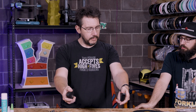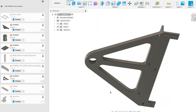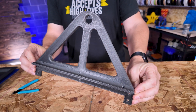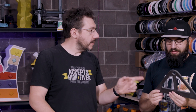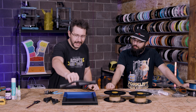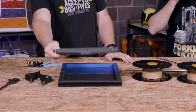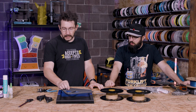Last for this build is the hitch — you have to have a way for your trailer to attach to the vehicle pulling it. This modeled up and came out pretty good. It was one of the last things I designed, so I'd gotten a bit better at Fusion by then. Simple shapes — triangles, holes, and a bunch of fillets to make it look pretty. Fillets make everything look great. This attaches to the underside of the extrusion with T-nuts, and with the wheels at the back and the tongue up front, we'll have a functioning trailer.